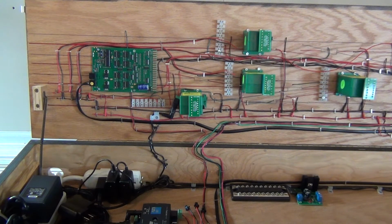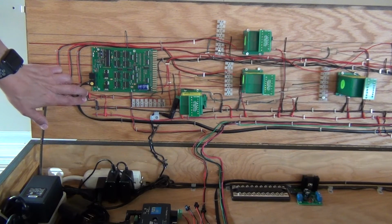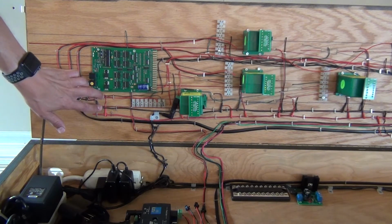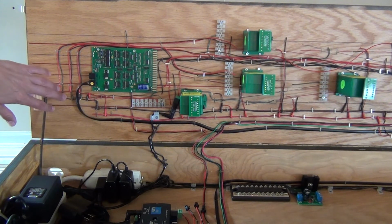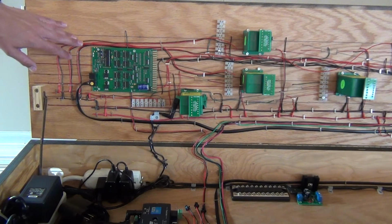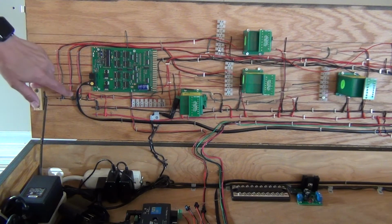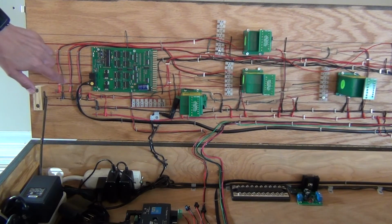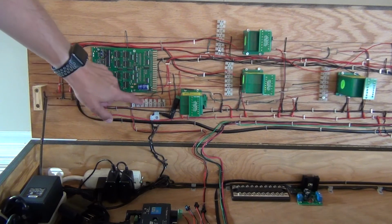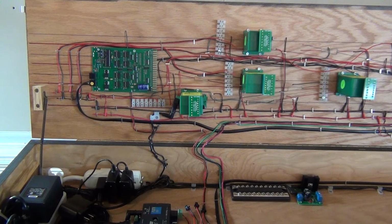Second thing you'll notice, and I apologize, I did not video this. If you remember back from part 2, I had 2 wires coming off here, off the bus line, and I told you these were going to be feeders for the turnout machines. So I went ahead and ran these lines as well, soldered these up and ran them. So I've got 4 sets total. This first set runs over here, is going to go to this switch machine. These go to the other 3 switch machines.